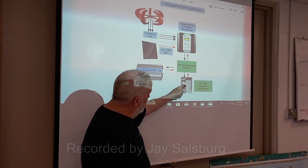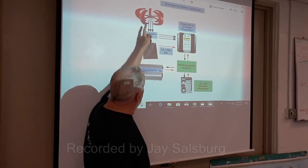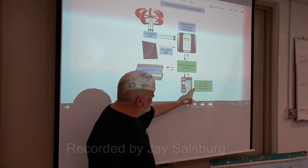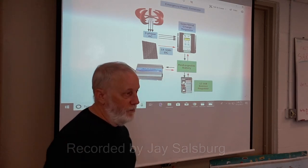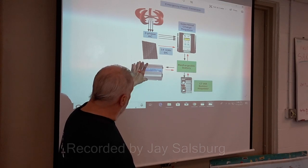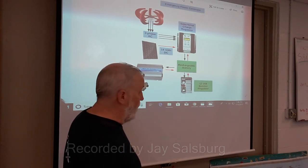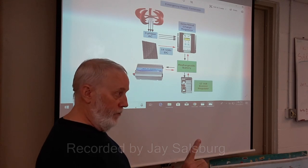So the battery can run your 12-volt systems independent of what the power system is doing going into the battery. The regulator booster keeps 12 volts in your system no matter what's going on with the power system. A good grid tie inverter, 2,000 watts, they're relatively expensive. But a grid tie can literally stop your meter from turning.